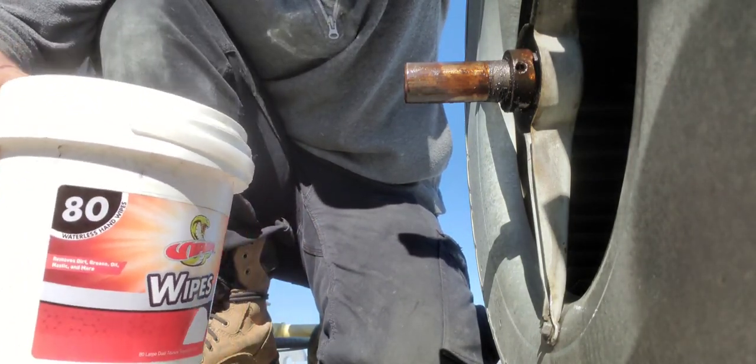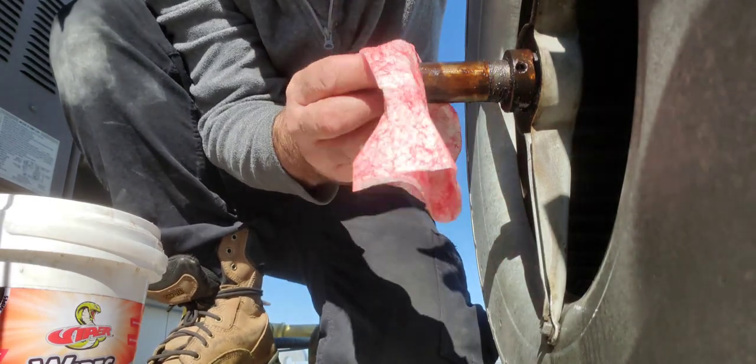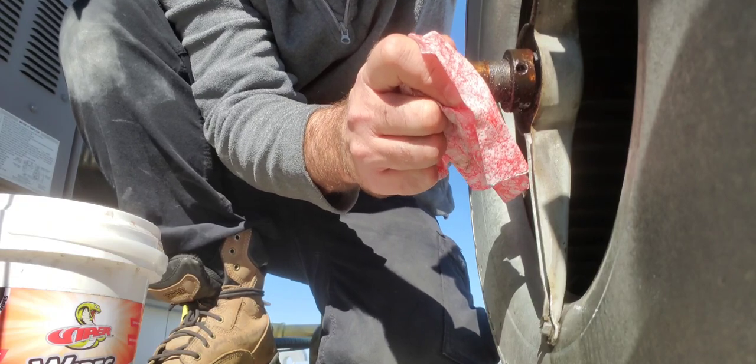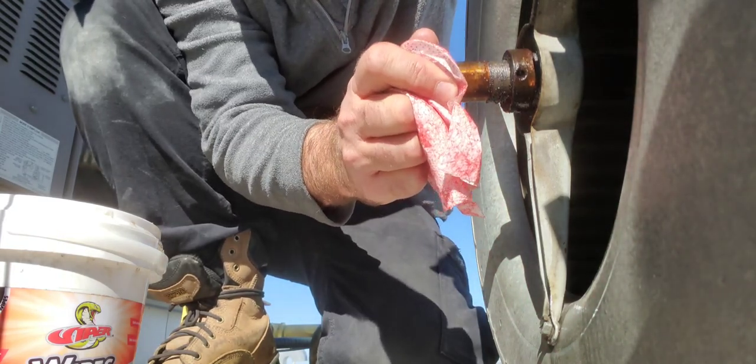Because when you're lubricating you have a lot of dirt and rust on the shaft, your hands tend to get dirty. But let me show you why this bearing needs to be changed — see that right there? That is play in the actual rubber sleeve that goes around the bearing insert.